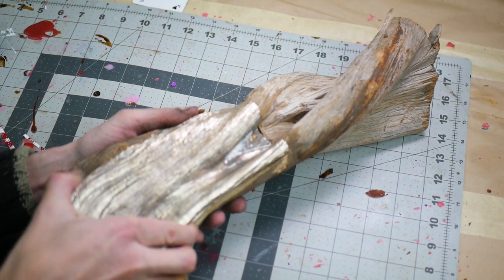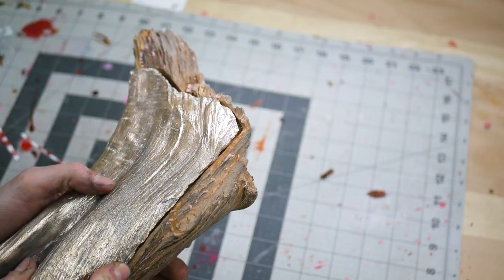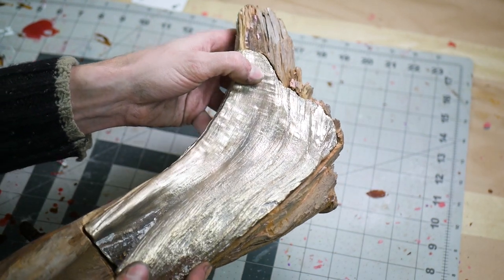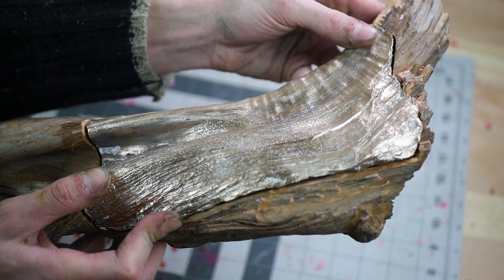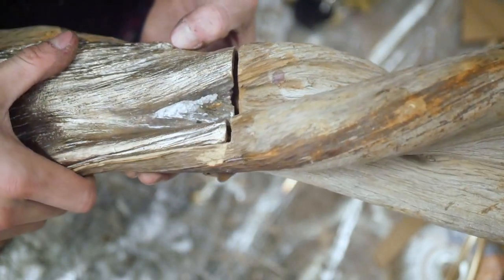It's not terrible, but you can see the huge gap that's been created due to the shrinkage. Some people might wonder why I didn't leave the original wax just a little bit bigger and trim it in metal, but for me it's easier if it ends up small so I can fit the entire piece into the wood area I carved out to see exactly where I need to add metal. If it were too big, I wouldn't be able to tell exactly where to trim and it would be far more guess and check work.